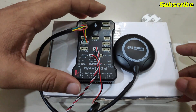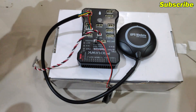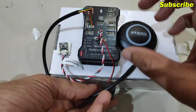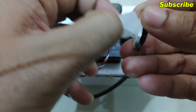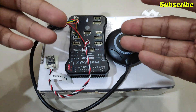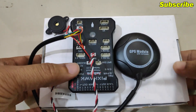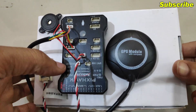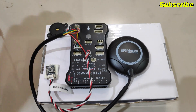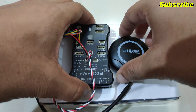I've secured the Pixhawk and just to keep the wires from moving around I'll tape them as well. This is an optional step — if you want, you can attach your electronics on the frame and then calibrate — but since I have to assemble the frame and I want to get the board calibrated and set up, I'm following this procedure. Here's where I've messed up: the USB port is on this side and I've attached the GPS module also on that side.